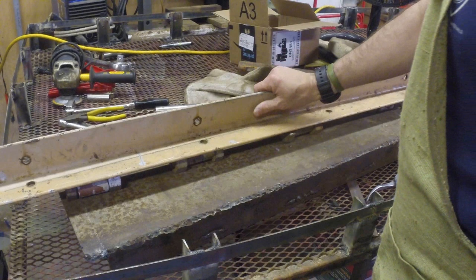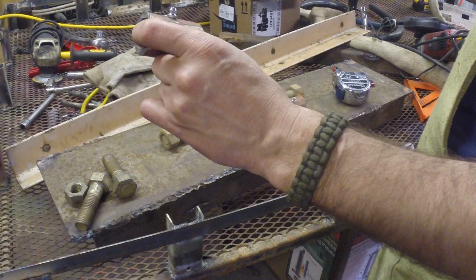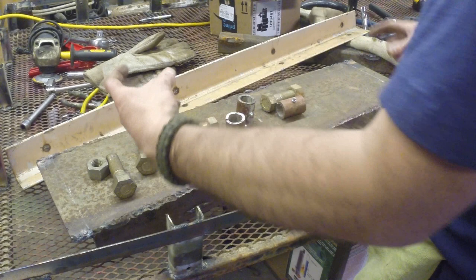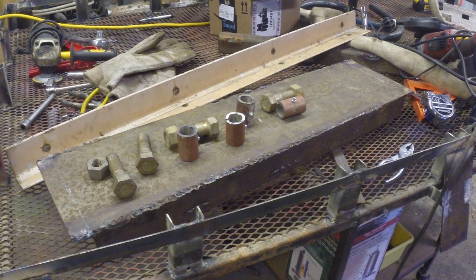It's been a while since I've done a build video so I'm long overdue. I got the other two hinges cut, got them all drilled and tapped, and zerk fittings put in them. Now I have to lay this out and make sure everything is perfect as far as where all the bolts go, because if you have it off a little bit it's just going to rip out of the bed — you'll have more pushing on one side than the other. I'm going to lay this out and see if I can get it right.